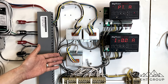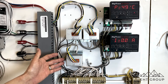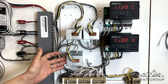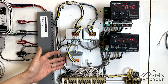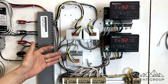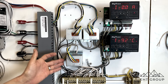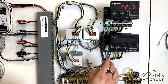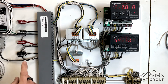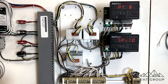Now these modules — I'm going to start with these guys. These are the 920 current transformer modules and these do much more than a typical CT. Not only does this module measure current from the Heat Trace circuits, but it's also used as the control power to our Heat Trace controller modules, and it's also used to do the switching for either a solid state relay, which is most common, or an EMR or a contactor.